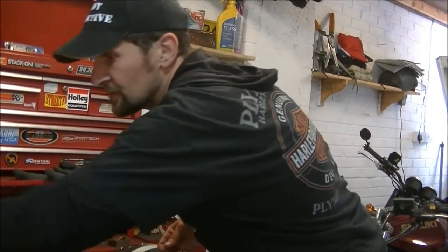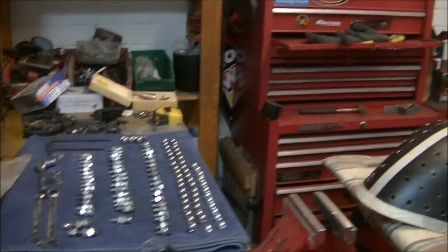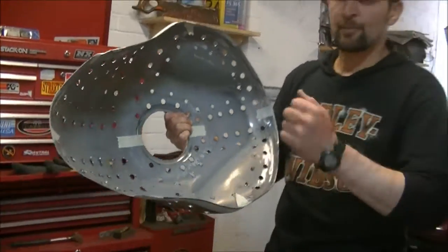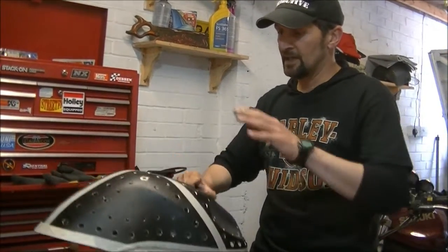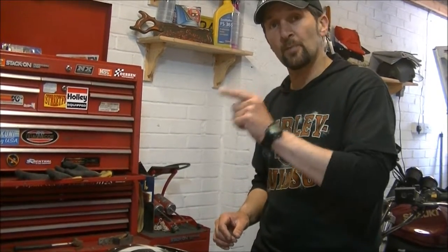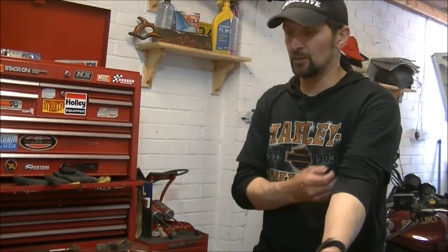And the bolts, as you can see here, are all ready. I can't put them in until I've deburred everything. And that inside, that's in a right old mess. So I need to get the lapper on that, get all of that out completely, which is just noisy and messy and time consuming, and then deburr all the outside, and then I can put them all in, because I want to put a coat of paint over it before I put them in, because I don't want to paint the bolts. I want to leave the bolts in steel so they actually look, because they're stainless, so that should look pretty cool. So there we are, that was it for number 10.